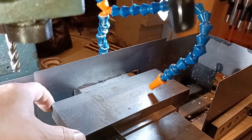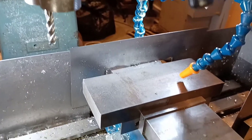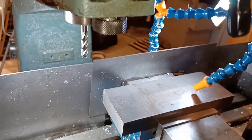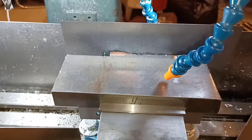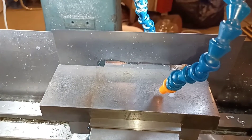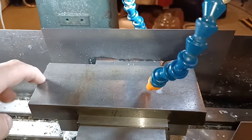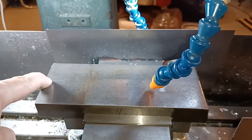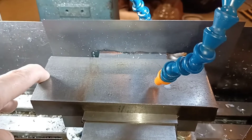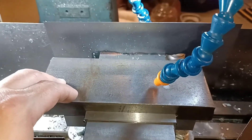Really, I don't have any other way I can think of to cut this. I can't put it in my bandsaw, and unfortunately on my chop saw the blade is shot — I've got one on order. I can't safely hold it to cut down the center. I'm thinking I'll slot it with an end mill, or use a machining blade on the horizontal mill, but I still run into the same holding problem. Maybe go down three-quarters of the way, stop, and finish it off on a bandsaw.